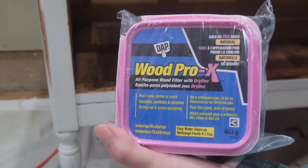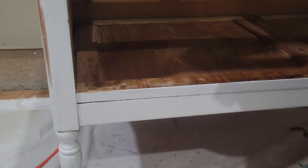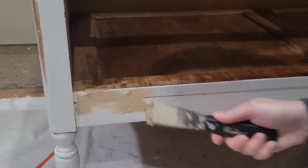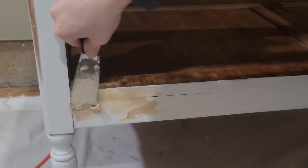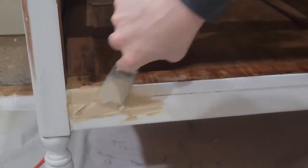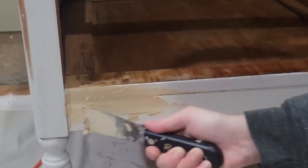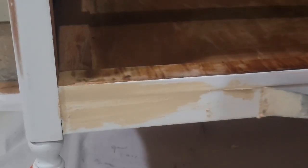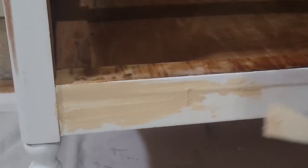As I was cleaning the piece I noticed there was quite a big gap on one side of the dresser compared to the other. I thought I would try to put some wood filler on it, but when I was moving the piece around it actually came apart even more. I did have to reinforce it with just a screw on the underside — I don't think I ended up filming it, but once I did that it was basically the same as the other side and I didn't have to put any more wood filler on it because the screw pulled the two pieces together.